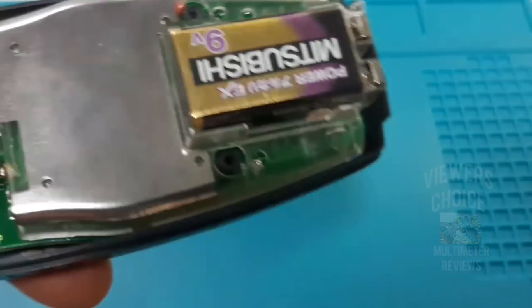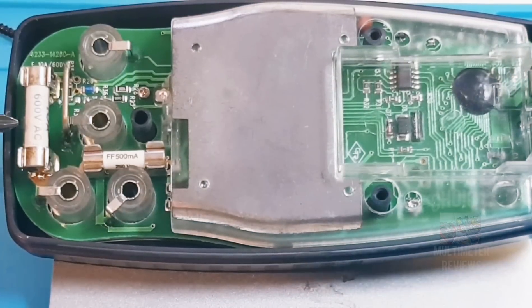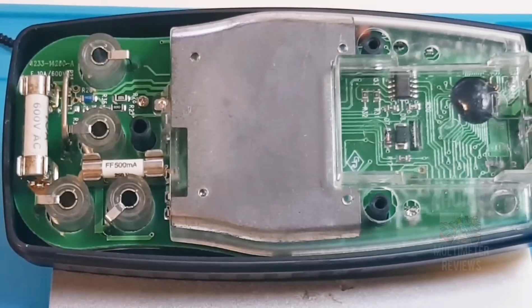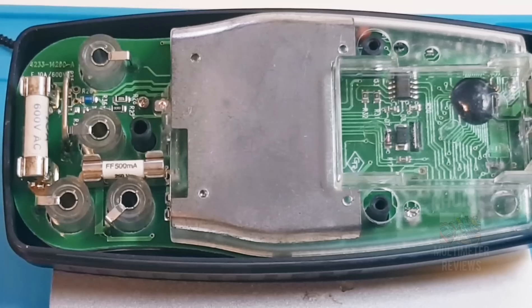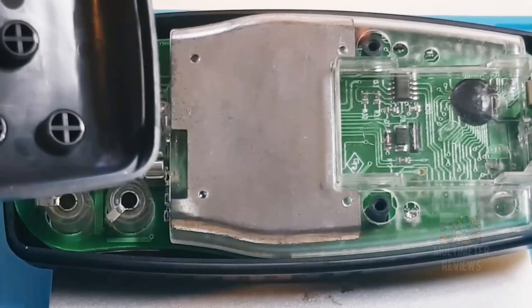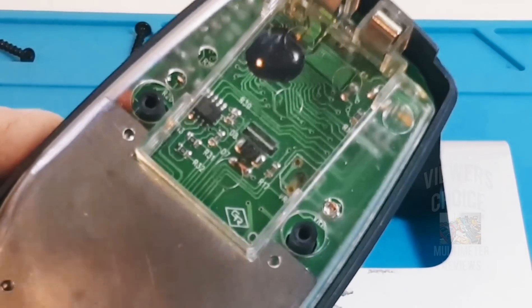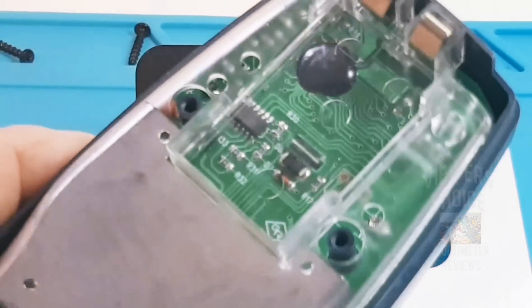When the battery is inserted it stays solid — no flopping or loose cables, really nice solid engineering. There's a 10-amp 600-volt ceramic fuse, and on the milliamp side, despite a 200-milliamp rating, they've put on a fast-blow 500-milliamp fuse. The jacks are a very snug fit of the split variety, and on the back of the chassis there are extended slots giving added back support to the jack inputs. You can even access the trim pot right through the translucent protector for calibration.